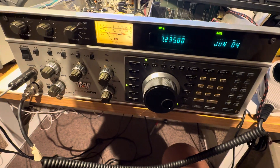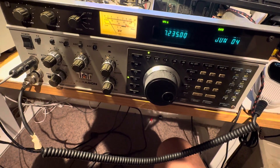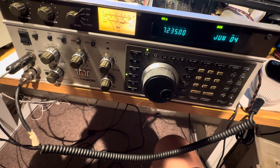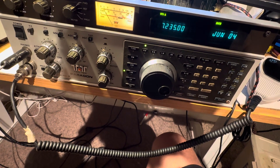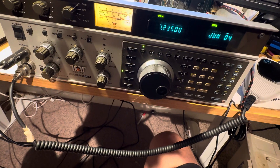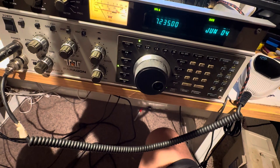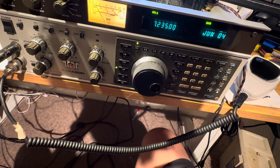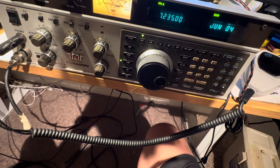Hello friends and followers. Here's a more or less working Paragon number two. This has been the radio from hell to fix, but maybe it's just me not understanding the circuit enough. I spent today going through the transmit line, the T line, the R line, the TD line. It's the TD line that matters, and if you get that thing working right, then the T and R will work automatically with the low level driver board.